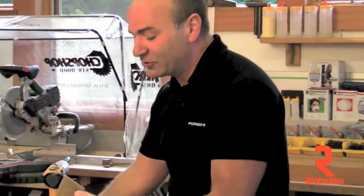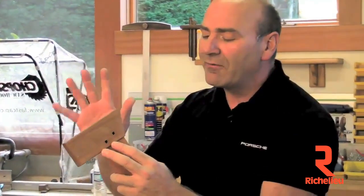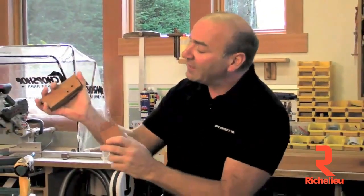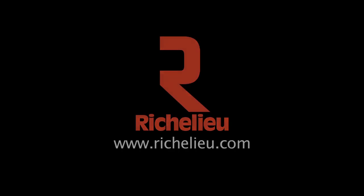So it looks like a mortise and tenon joint, but it could technically be just a butt joint — you could even put a screw in there, whatever you want. And then you've got the look of the mortise and tenon with the pinning without all the hassle. That's what that's all about. I just wanted to show you conceptually how that works.